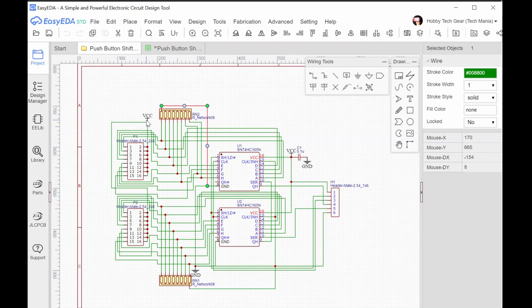The pull-up configuration is important for energy efficiency: if the input is not used and pulled up to 5V, it won't drain current from the chip. But if pulled down to ground when unused, it will drain current continuously. When a switch is closed and connects to ground, it creates a zero at that pin, which the shift register reads and reflects in MMJoy firmware as a pressed button.